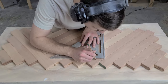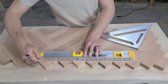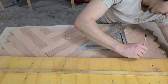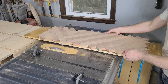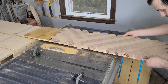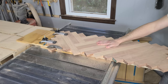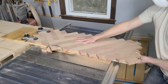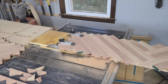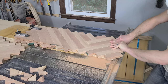Once the panel is sanded, it's back over to the work table to mark out where the panel will need to be cut. We do this by comparing the panel to our layout lines from earlier, and then carefully marking our panel so that the cut ends up in the right location. With everything marked, we bring the mosaic panels over to the table saw. Our tapering jig makes getting a straight edge on these pieces pretty easy. The hardest part is just finding a good way to clamp down the pieces. This second panel actually shifted slightly when it was being cut, but we'll be able to hide that inside the frame of the headboard.